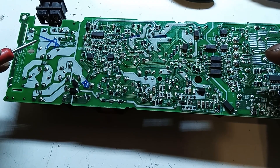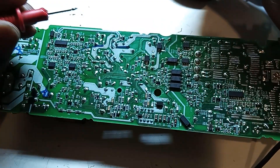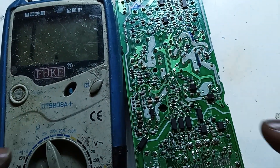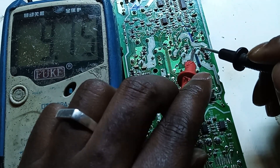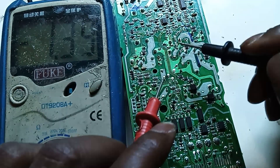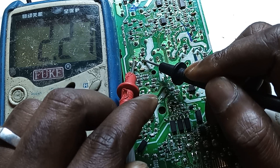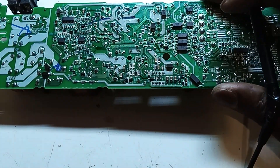The usual check I do when working on power supplies — I need to check the resistance. Let's see if we can see there. So if you're getting about 10 ohms over here, we're good. But now we're getting a reading which is that of a diode — usually won't get nothing there. Okay, so we come over here and it is not good. We're getting about 0.45 — it should be about 9-point-something.